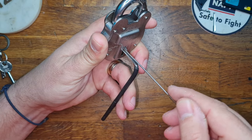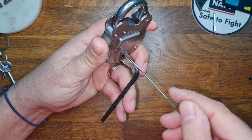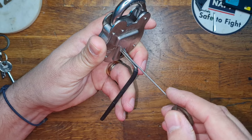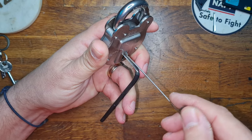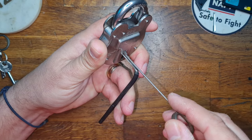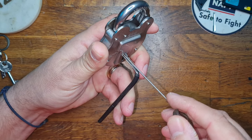As soon as we feel it's stiff, we start lifting it until it goes loose, and then we work our way around the pack. As we're going up and down the pack, the tension lever may move in the direction that the key would normally go — this is a good sign as the bolt is slowly progressing along its path. Apply a little bit more tension and find the levers that we're missing.